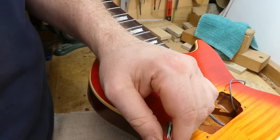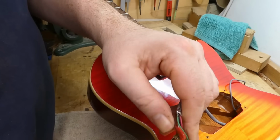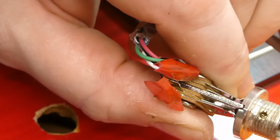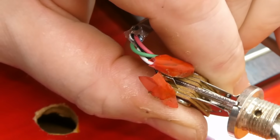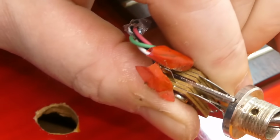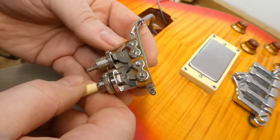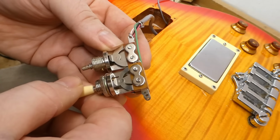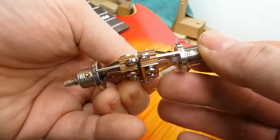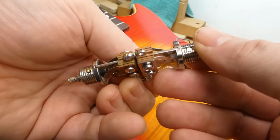The little axle which the switch tip runs on has broken or has come loose. I can see that it's not separating the leaves of the connection every time I flip it. So that's always on. We'll get rid of it and put a new one in. Gotta make sure it's a switch of the same dimensions, obviously. Looking at it end on, the new one is marginally wider, specifically the screws. So I don't think that's going to be an issue.